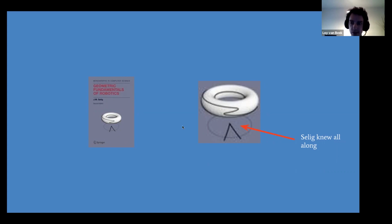Hey, can I ask a question? So I wonder, are there any classes of robots that are definitely not cuspidal? Because I'm not sure if I can completely wrap my head around this just yet, so I might have to go over the recording in a couple of weeks. But are there classes of robots that are definitely not cuspidal? So if you determine somehow that your robot has this cuspidality feature, I guess, what's an easy fix for that? Can you, for example, just add another joint to it, say to this third link of the 3R robot you showed, can you add another rotational joint to it and lose the cuspidality? But then, of course, you trade that for higher dimensionality and a different problem. Can you always do that?